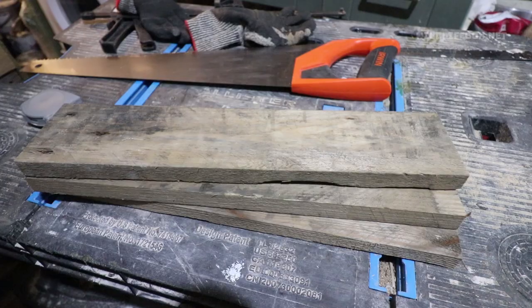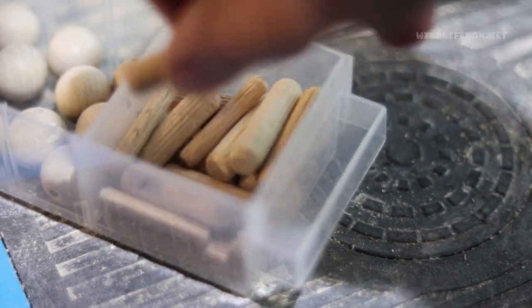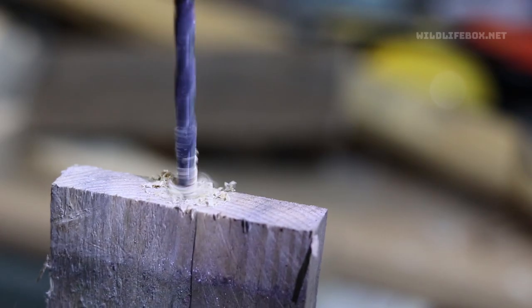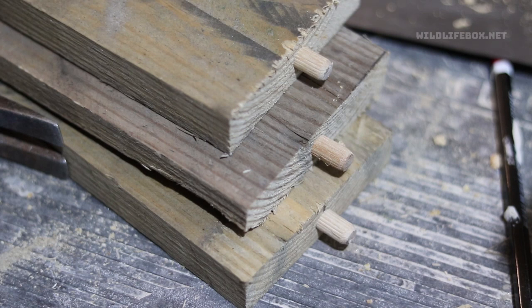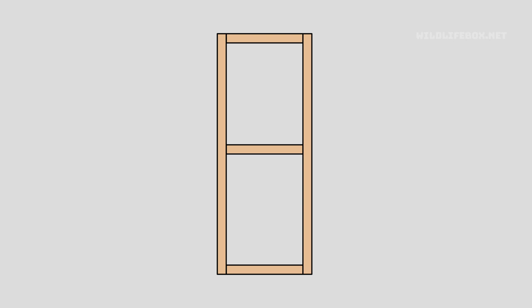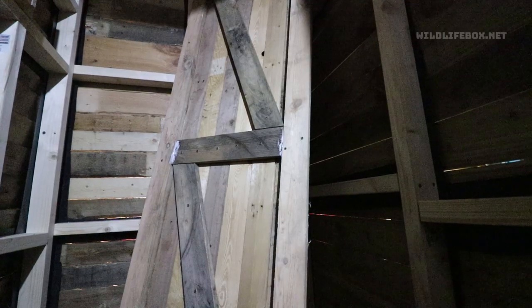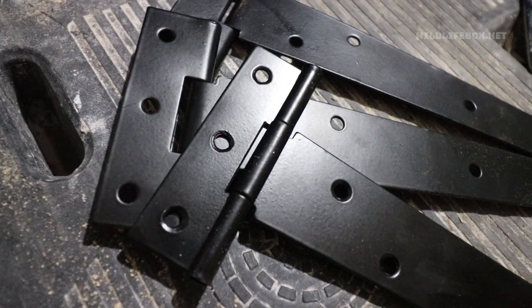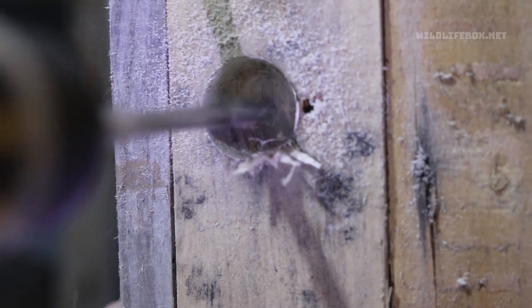Next I'm going to build the door. I got several shorter lengths of pallet wood and then added some little dowels to the end of each piece — I drilled a hole and then hammered them in. I then got two longer lengths and drilled holes in the centre, top, and middle. I added some supports and then once that was done I added some longer lengths to create the finished door. I also used some wood glue to secure the wood in place. Next I found some black hinges which I thought would be perfect and then screwed the door in place. I also found an old Suffolk latch which I thought would be really good for the door handle.